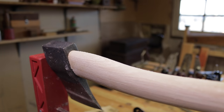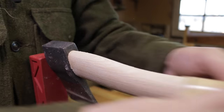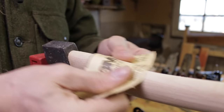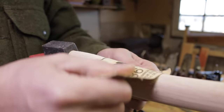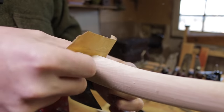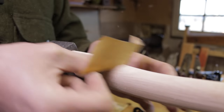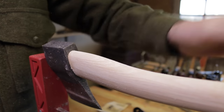If I take something smoother like 320 grit, what happens is the varnish starts heating up and it really starts to load up, and once it loads up like that it doesn't cut very well. So ideally what I'll typically do is get all that varnish off with a coarse 36, 60, or even 80 grit, and then come in with your 180 or 320 - 320 is as smooth as you'd want it. That's what I do when finishing axe handles for different people. I used to finish with 320 more typically, but now I like the hand-scraped look better. But this is also a pretty good way to do it - that's a pretty nice finish.